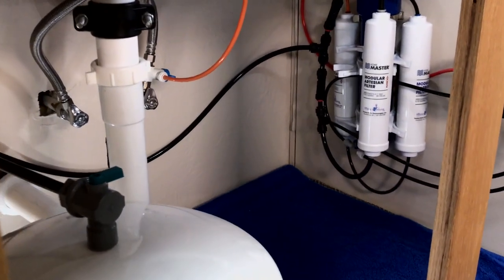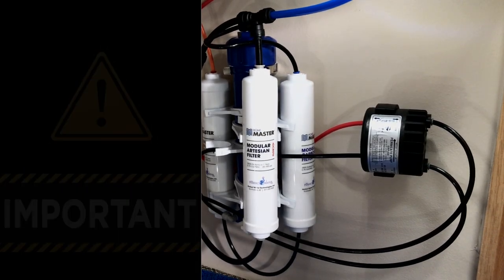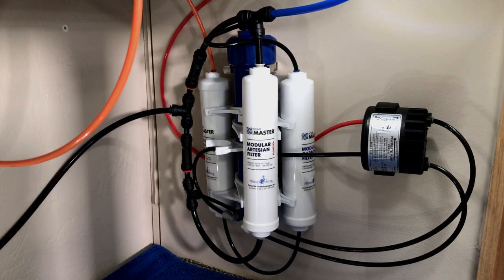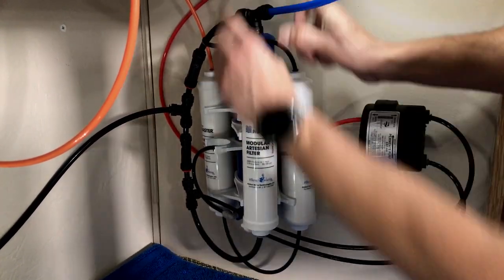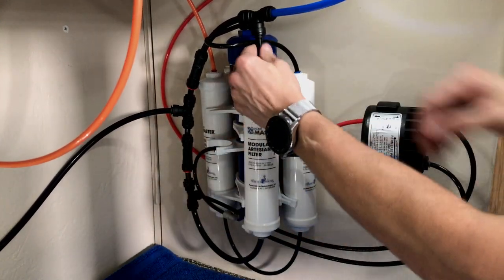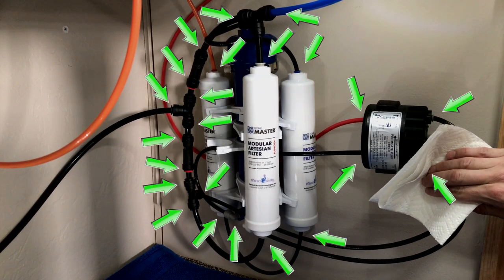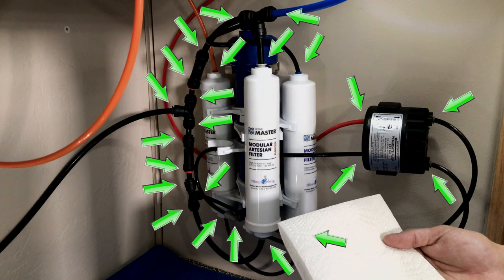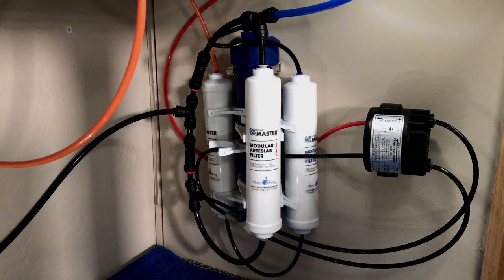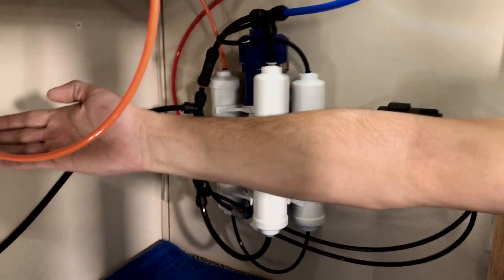This is very important: if your system contains a UV filter, please proceed to plug in the power supply. Now for the leak check — please tug on each tube gently; don't try to rip it out, simply tug on each of the tubes to make sure that the teeth inside the collet ring have locked onto each tube. Next, use a paper towel to gently touch the tube where it meets the collet ring — don't put any pressure on the collet ring, just simply touch it with a paper towel so you can examine it and look for signs of water. Once you have confirmed there is no water, examine each of the remaining fittings, including the ones we have not touched today.